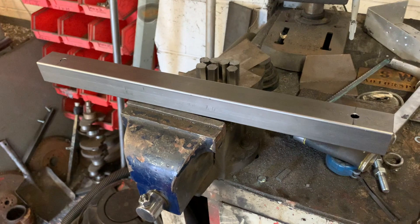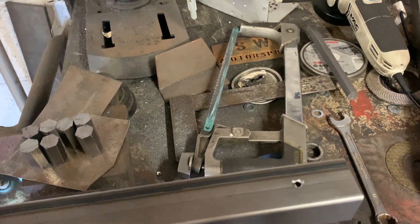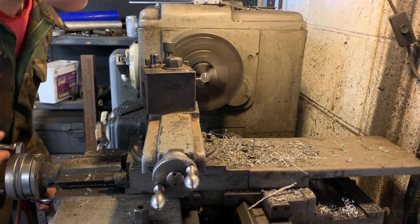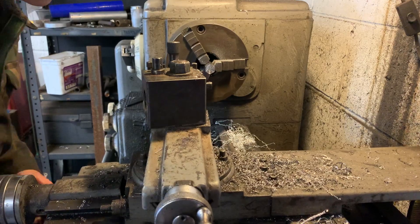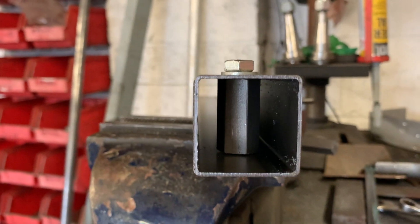All the little hex pieces are now cut and Steve's oldest is going to start machining those for me. All the box section is prepped — drilled with nine-and-a-half mil holes in the top and five mil in the bottom, just needing a bit of tidying up. Steve's oldest has been an absolute star getting these parts machined. The first one is done and he's working on the second, and we're just going to put a couple of tacks to hold it in place.